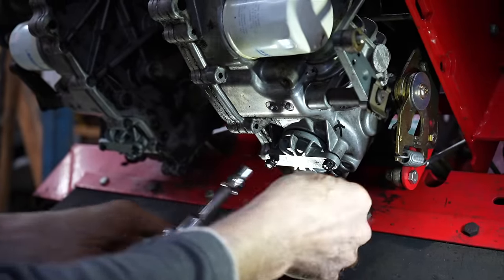A lot of times it helps to use the relief valves — on this model they're under here — to purge that air out. It takes a little while. I know some shops have a way of pressurizing it to put a little pressure on there. You can see the oil levels have dropped way down. I had them all at the top, now they're down at the bottom. This one is real low and that one's pretty low. I'm going to have to add a little bit more oil. Don't freak out — sometimes you've got to give the hubs a little help, spin them a bit to get them going. Once you get all that air purged out, it starts working again.